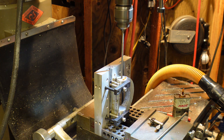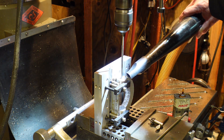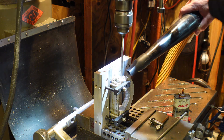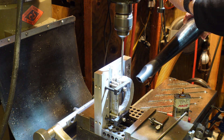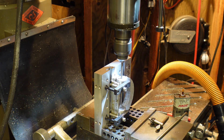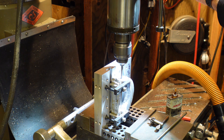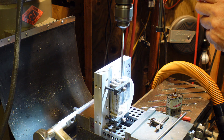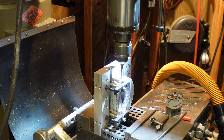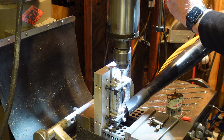I've got an extra long drill bit here so I can actually drill through the top barrel which is on center and pick up the bottom barrel. I've got the vacuum on a foot switch so I can start and stop the vacuum just by hitting the pedal on the floor, which is really nice and handy. This is an undersized drill — I was going for 0.250 quarter inch — and then I was going to come back through with a reamer, a thou over 0.250. I'm going to use the quarter inch for my locating as I continue through the machining of this.